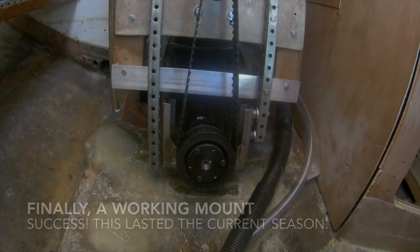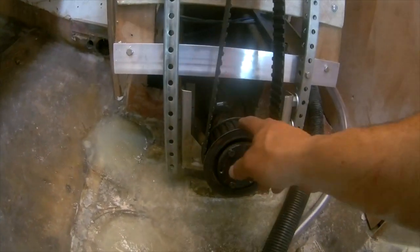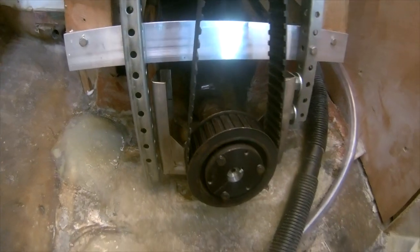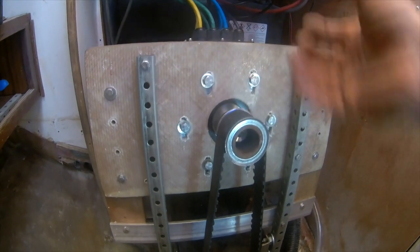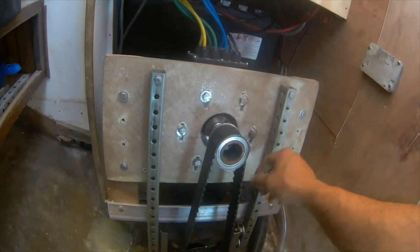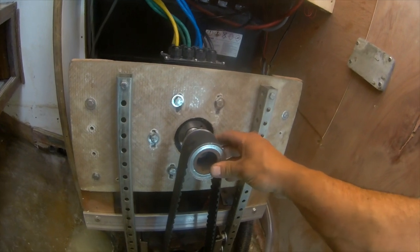Finally some success here. Pretty happy about the final mount — it's working well, nothing's moving. You can see from the video the box channel on the left has been extended, and I did the same with the right as well. By using spacers and washers, I can align the shaft left or right, and I can align the shaft up or down by the washers on the support bracket mounts on those L brackets. The collars on the shaft help me move it forward or backwards, so I've solved my alignment issues. The belt was straight — I could see it wasn't chafing one side of the belt at all. This is the design I've been running with for the season. I've got a few hours on it now and it seems to have smoothened out and worked well.